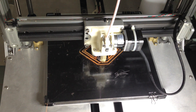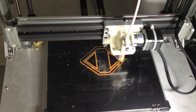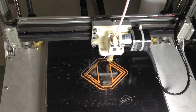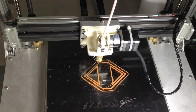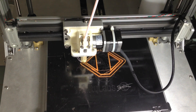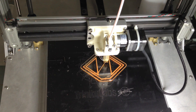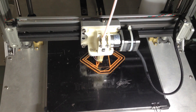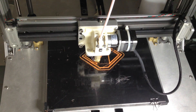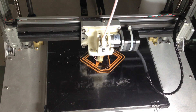There's a little bit of a problem on the left hand side of the print which is due to the print bed being too high on the left side. You see how the plastic's a little uneven? If you look along the edges of the traces on the right side they're sharp and crisp with a well-defined edge, and on the left hand side it's kind of rippled. That's from too much plastic being extruded in too small of a space because the platform's too high there. This isn't enough to kill the print — it'll normally be covered up with another two or three layers on top of that. It should even out.